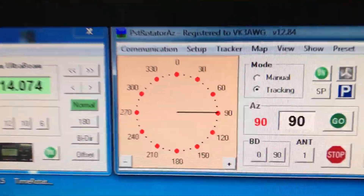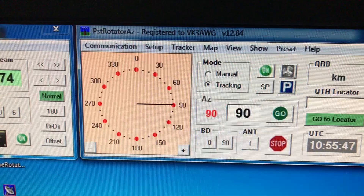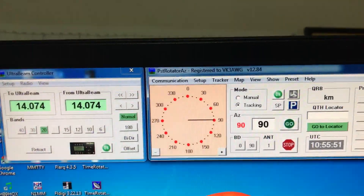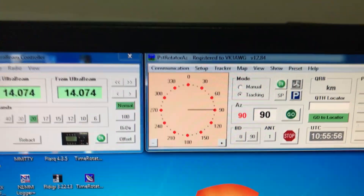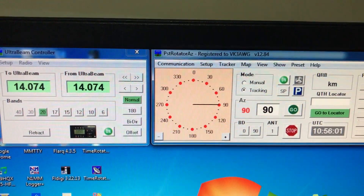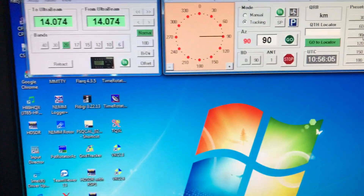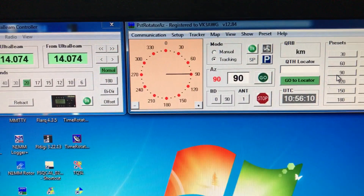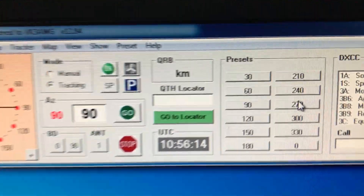What we're going to do is go from 90 degrees to 270 degrees through north and see how long it takes. I've already done it — at 22 volts it takes 45 seconds, at 20 volts it was a minute and 28, at 12 volts it was a minute and 45. That's 22 volts here at the bottom, not at the top of the tower. We'll click on 270 — I've got the macro over here.